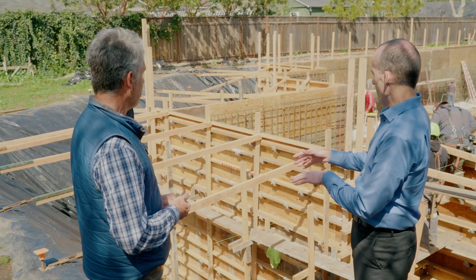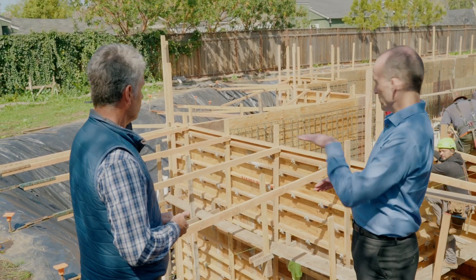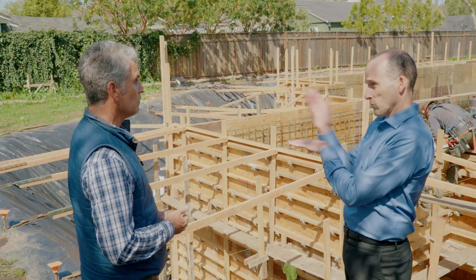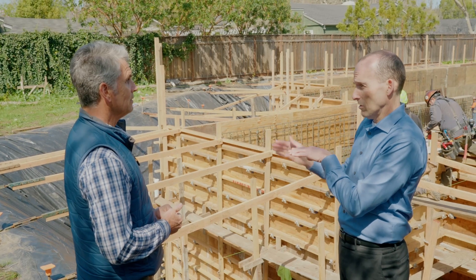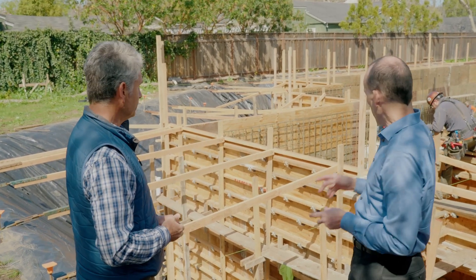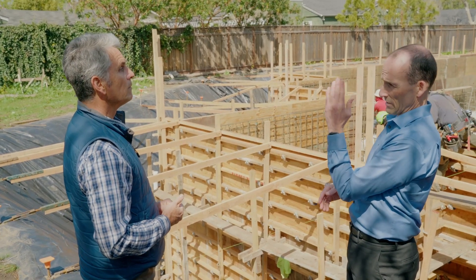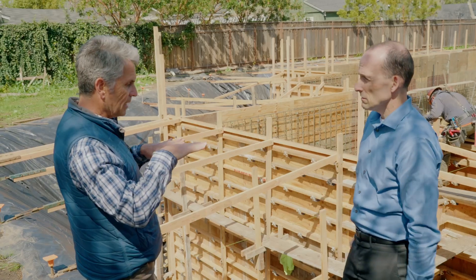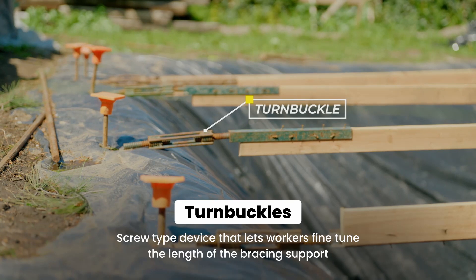So all the wood goes away. The two-by-fours going horizontally keep the wall straight in a longitudinal manner — true to itself along the same plane as the string line. The vertical ones keep it straight up and down. A turnbuckle allows you to push and pull it so it ends up precisely on the string line.